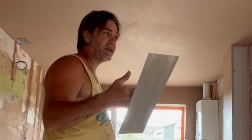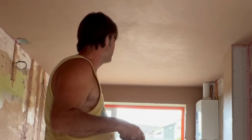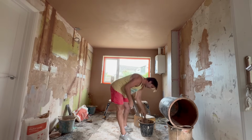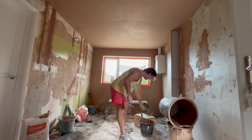It's more like a finishing trowel. It's the last couple of times you're going to visit the wall. You've got to have cleaned all those ripples and all that stuff out before you can start sheening up the surface everybody likes to see. I would just treat it in exactly the same manner, in a systematic way, as the ceiling went on.